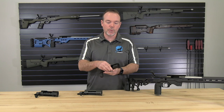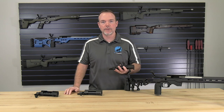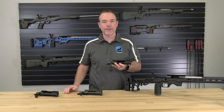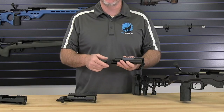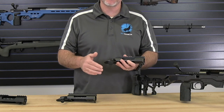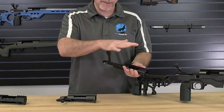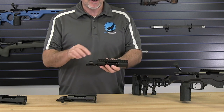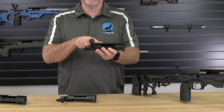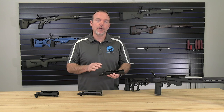When we designed the first one it was a traditional 700 round — it sort of looked like the Igniter now, but with a built-in 20 MOA steel rail machined into it. When we came out with the Elite version, which is the newer version we offer, we actually machined flats into the side for rigidity to make the action a little bit thicker. It adds some weight, but it also has a built-in steel 20 MOA rail.